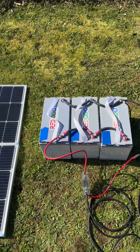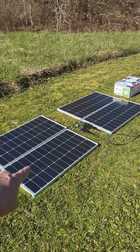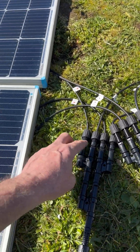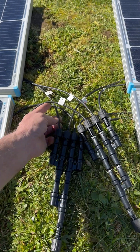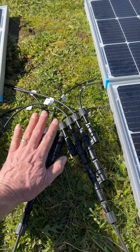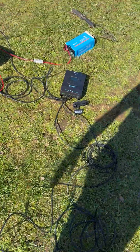This fuse actually came with the Renogy kit — it's a 40 amp fuse, so we've got that just about right. Now backing away, we have your four panels here — four 100-watt panels — and they're connected together through a whole bunch of adapters. These are two-part adapters that go to one. On top you have negative, negative, negative, negative — so this string is negative and the other string is all positives. These are hooked up in parallel, just like the batteries.